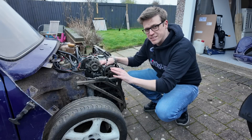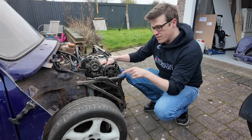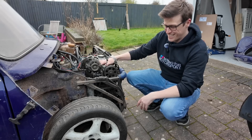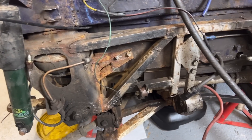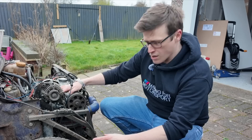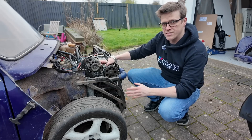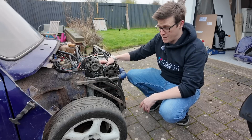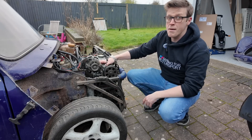Then there's the subframe itself. It's far too weak. In fact, if I hit the brakes too hard, then the top arm on the suspension flops around. And just look at it — it's horrible. It looks like random bits have been added after the event by a blind toddler learning to weld. Badly. And that's because that's pretty much what happened — I designed this. No, not designed. I did not design this, I just made it. And I made it far too lightweight and far too weak. I've had to add lots of triangulations which have made it quite heavy, and it's still not strong. To help you visualise the problem, I've made a scale model.